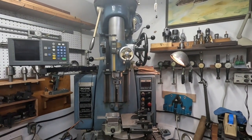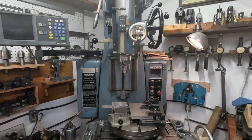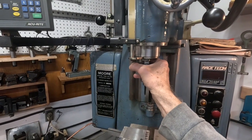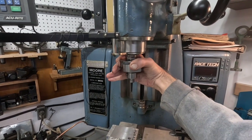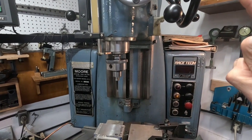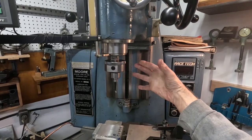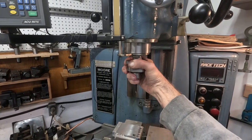Here's the tip: if you keep them in the middle you can turn the spindle by hand. This machine sat for quite a while, so if I turn the boring head, see — it pops back. That's from the set in the belt where they wrap around the pulley. They get a kink, and it's not as severe a kink as if you left it in high or low. So you keep turning it until it doesn't pop back.